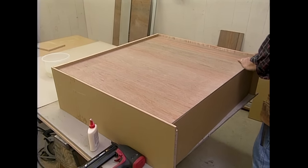There are a couple more things I want to take care of up here. I want to put some open shelves with no doors in the middle, and I want to attach my drawer fronts. The open shelves are going to sit on some 3/4 by 3/4-inch cleats just made out of plywood. I pre-drilled holes and I'm using some 1-1/4-inch screws to fasten them. Now the shelves just sit on the cleats, and I'll put a couple brads just so they won't slide out. I think I'll rip some strips of pine to dress up the front edge — a little bit of glue where the pine meets the plywood, and I attach it with some brads.